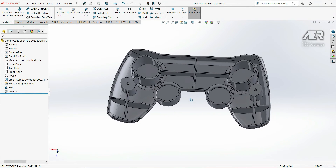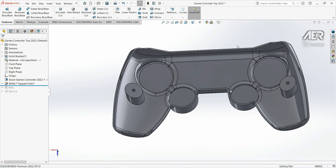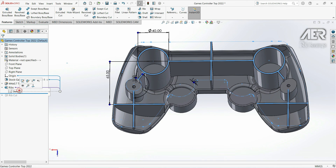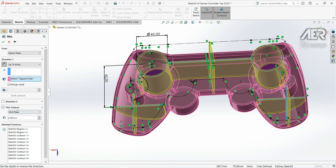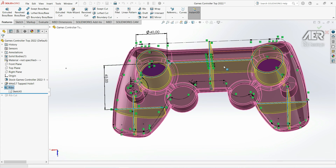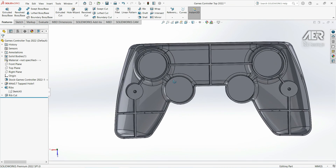To recap: we started by adding the tapped holes — we didn't have a flat face on top of the standoffs but used a different flat face in the Hole Wizard and lined the holes up with the standoffs from above. We had a quick look at the Rib feature and found it works for a simple straight cut but not in our case because of the angled edges. Instead we made the ribs using the Thin Feature: draw the rib sketch, go to Extruded Boss/Base, choose Thin Feature, select the contours, set the thickness, choose Midplane, and extrude Up To Body. Finally we cut away the excess ribs by sketching on the front plane, converting the cut edge, and using Extruded Cut keeping only the main body. In the next video we'll add those ribs to the bottom part — it will be easier because we can reuse the sketch we already made. Thanks for watching!